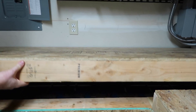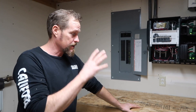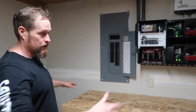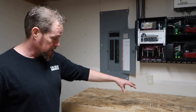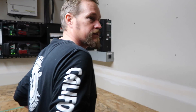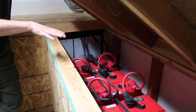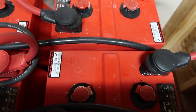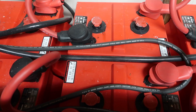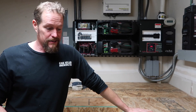The newest one of these batteries is about 40 years old and the oldest could be up to 100 years old. They're a high-dollar battery with low energy density — that whole bank is roughly three feet high and a good six feet long, and that all makes up a 24-volt, 500-amp battery. On this side we have the more traditional lead acid batteries, and each one of these is about 1,400 amp-hours, so it's considerably more energy-dense.